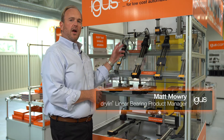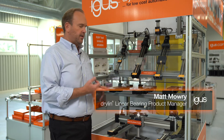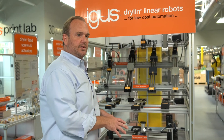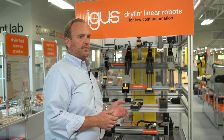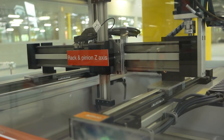These are all based on our dry-running, lubrication-free linear actuators — belt drives, screw drives, gear racks. We offer them from stock as standard lengths, but they're also very modular and customizable for your application. They're ideal for loads under 24 Newtons and positioning accuracy of 1-2mm, roughly, for your end-of-arm tooling.